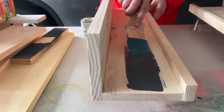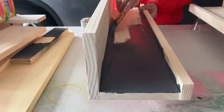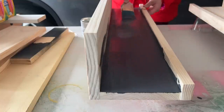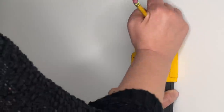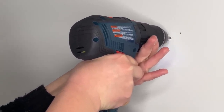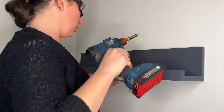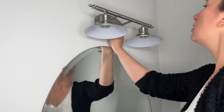I'm using more leftover paint — this was leftover from a bedroom project. I'm just going to add a couple of coats of this really nice navy black paint; I think it'll add a really nice modern edge next to that softer blue and yellow. Now I'm finding the studs and marking them. Drilling pilot holes into the studs is going to help a lot when I go to install these shelves — I want two screws driving straight into the studs to keep each shelf secure.